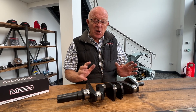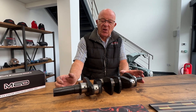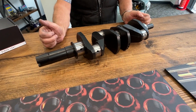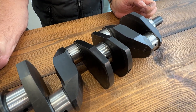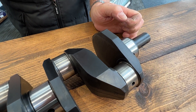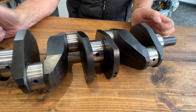Recently we acquired a batch of brand new old stock Rover 1275 A-plus crankshafts and we've had them fully modified. These have been modified on a CNC machine to a program which puts in many, many features to the wedging and lightening process.